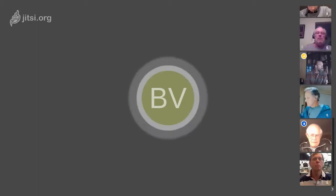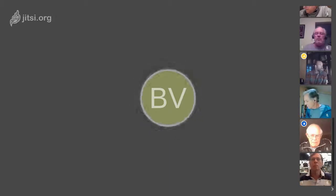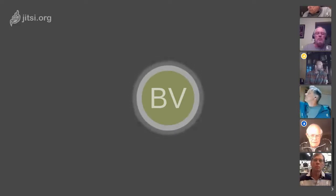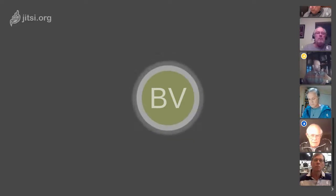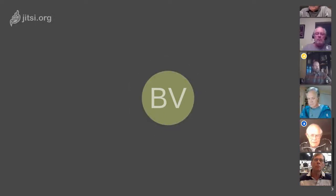And just one other thing on the new components, people are always contributing on these things. One of the caps that were there was two electrolytics replaced by smaller ones. Some guy had come forward and said, look, this is an audio chain thing, use polyester caps. So I'm going to try to do that on the other one, just because they treat audio much nicer. So there we go. That's the report from here.